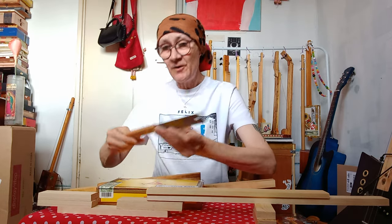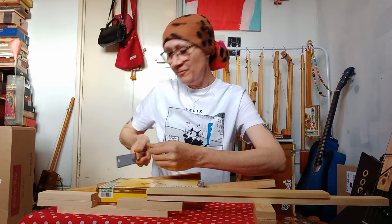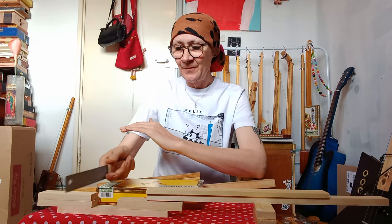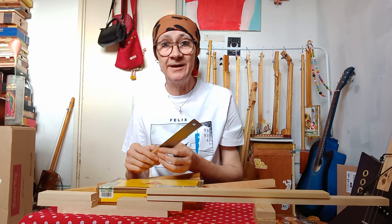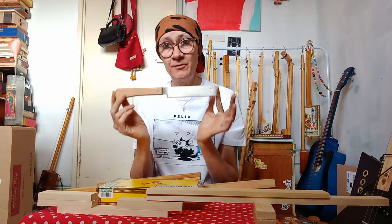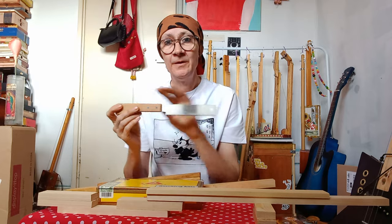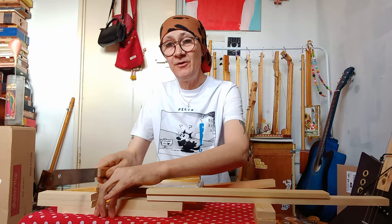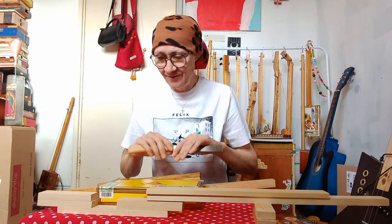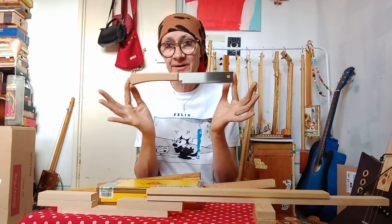I do find that these cut very nice straight lines. They take a bit of getting used to because at first they're a bit counterintuitive if you've been using standard saws. It's got more of a knife handle, so when you're cutting it's good to keep your arm at a right angle and you'll get a nice straight cut. Another tip — Chicken Bone John quoted his dad who said basically when you've bought a saw, use the whole saw. You want a nice smooth action across the whole length of the blade and you'll get accurate cuts.